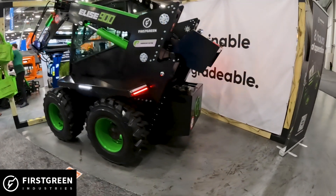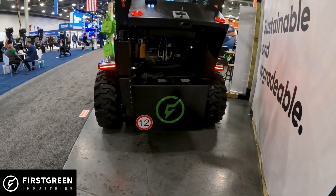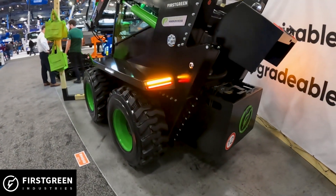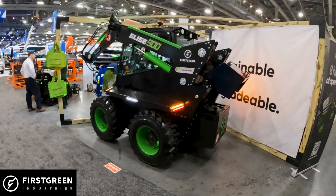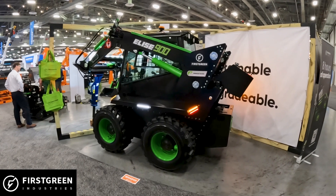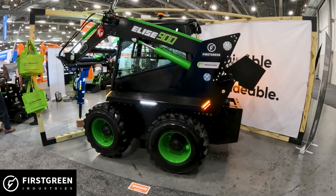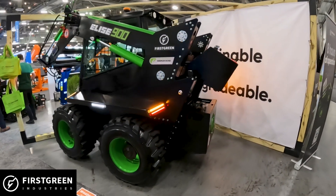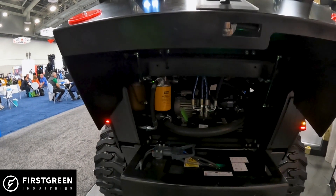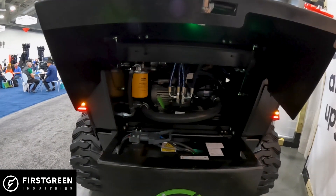If you did need to change a belt, you'd just pull the back cover off to get access to the battery — fork pockets, use a forklift, slide the battery right out, and then you have access to change the belts. Maintenance-wise, it's almost zero. On these electric machines you've basically got grease. We do have final drive planetaries on the wheels, so we'd have to change that oil at some point, and of course there's hydraulic oil and a hydraulic filter. It's called a long life hydraulic oil, so maybe every thousand hours we'd service that hydraulic system.